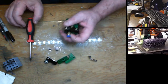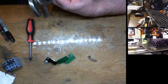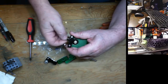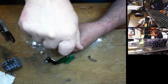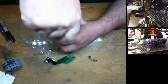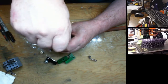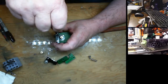Let's see, I had some channel locks. Anyway, that's when I found the problem that I couldn't control the steps per millimeter for extruder 1, and kind of made my rant video because I was ticked off. So, I've made several mods besides the hot end and the fan duct and all my Z and X and Y stops and all that sort of stuff,